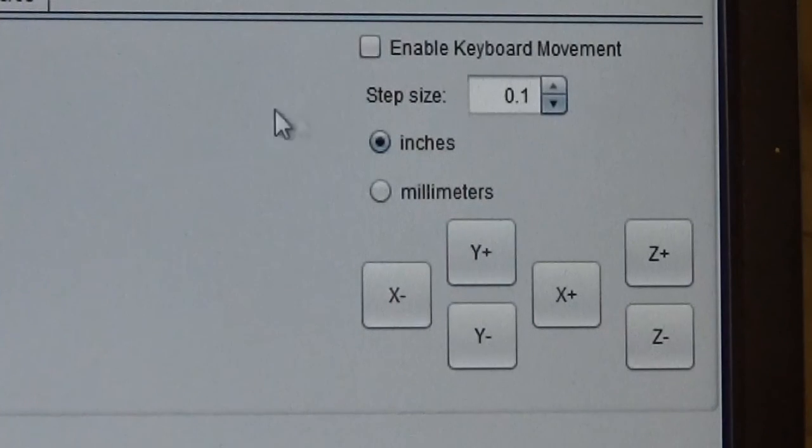The easiest way to accomplish this is if you remember those numbers we looked at a moment ago, which showed work position at X 2.65. So what I'm going to do is go right here and type in 2.65. Now, the big thing to remember here is that if you're in inches, and that's what's reported on the left over machine position, then you're fine. Sometimes you'll see that 2.65 might be a larger number.